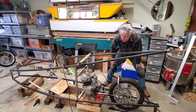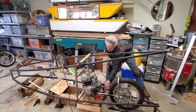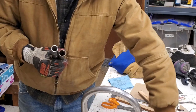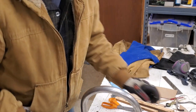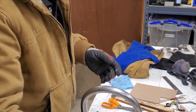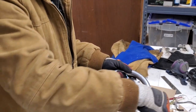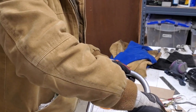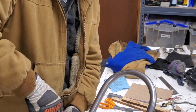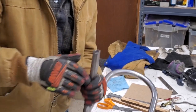Right now I'm working on the rear swing arm — I've got to chop that down again and figure out how to locate it onto this bar here. And here we go, took off quite a bit of length. Luckily, one-inch tubing goes into this one-and-an-eighth metric tubing perfectly. Should get a few reps at the hammer and see what happens.